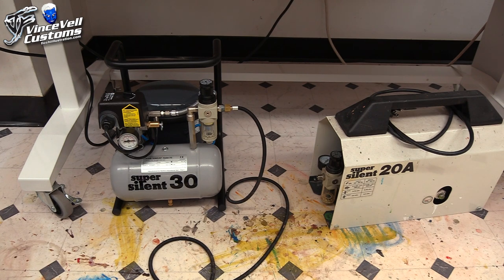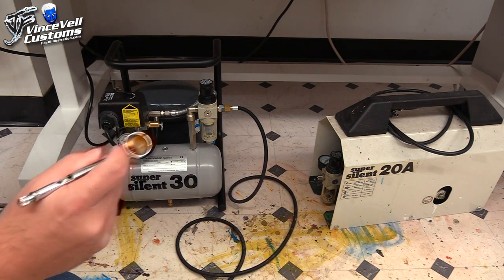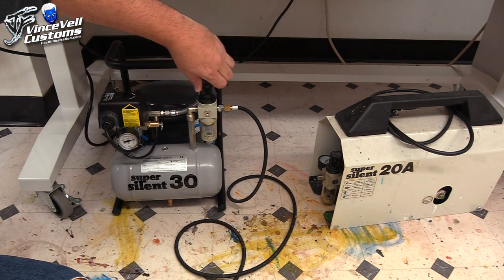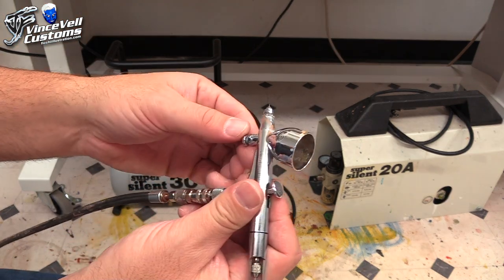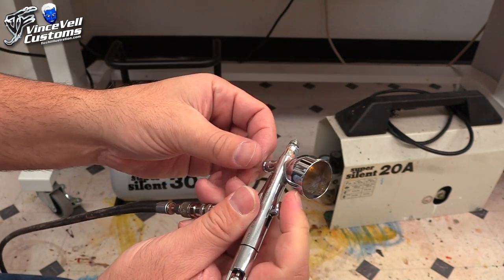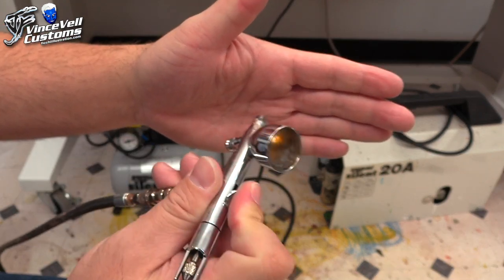Say you need to get into your garage but you don't want to plug this in — you just want to airbrush something. If you fill up the tank, you'll have enough to maybe spray something down real quick. That's full blast. What I like to do is keep my pressure around 35 to 40 PSI or so when I use this airbrush, and I can use this here to adjust my pressure. So I've got low pressure, higher pressure, going crazy — it's a really great compressor.